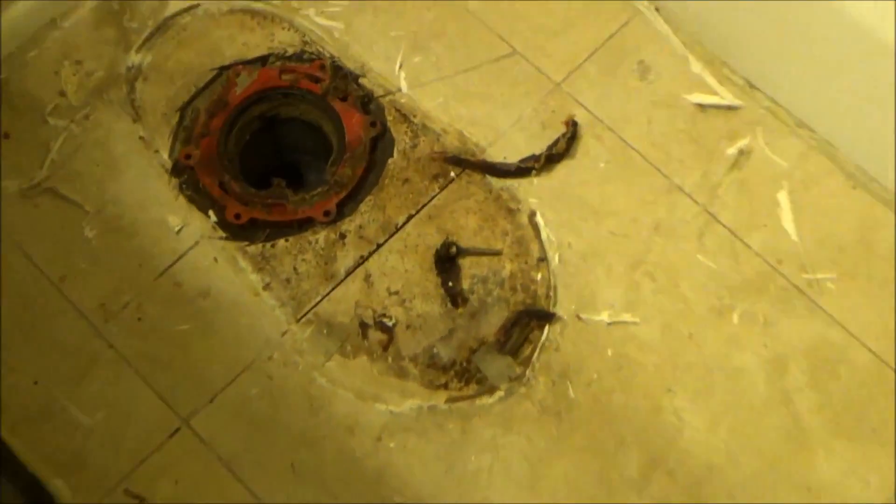Mark, I'm going to guess Brandon's guys did the tile here at this condo in four. Look, I know you hate when I bitch about these other guys, but check this out. This toilet we just took off had a half-inch worth of shims up underneath it, holding it off the ground right there. That's why you got all that caulk buildup.